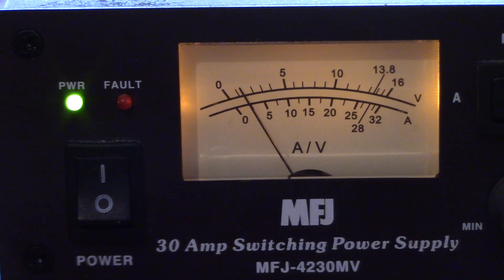Another thing I want to show is the amount of amps you're pulling at 100 watts single sideband. We checked the frequency at 100 watts and called CQ. As you can see, it was just bumping up on the peaks around 12 to 13 amps, which is below the 15 amp limit. Now if you're running CW or digital modes, I wouldn't run 100 watts — I'd get down below 50 for that. But for sideband, your peaks are not getting high enough to cause any issue.